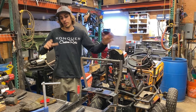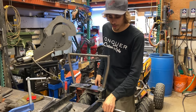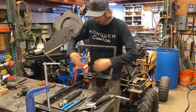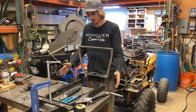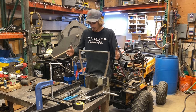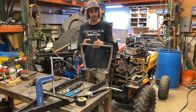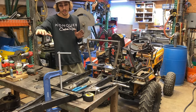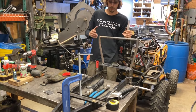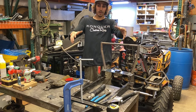We've done a few things to get the trailer further along. The arms are in here, just loosely put in and tack welded together, just so we can figure out the zero axis so the tires are both spinning and driving straight — perpendicular to the trailer. We put a couple uprights in here, bent them up, put the strain across. The next thing we're going to be doing is building the rest of the trailer out forward, so we're cutting up some tube right now.